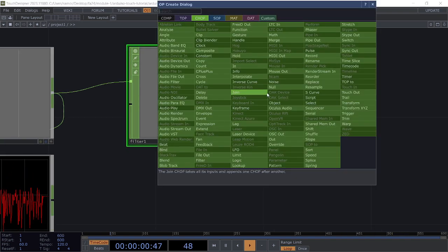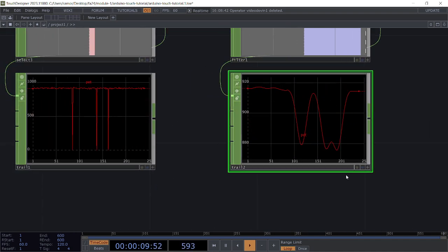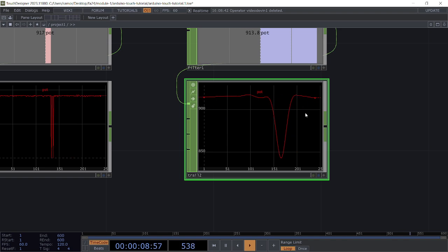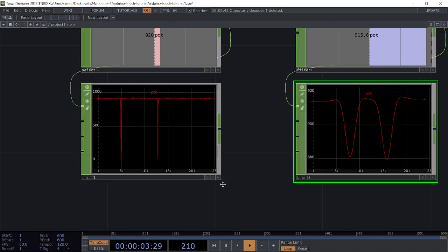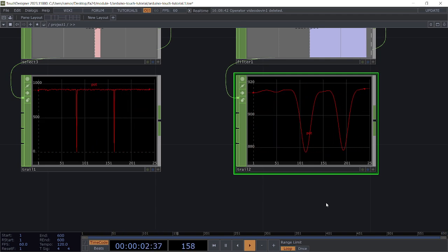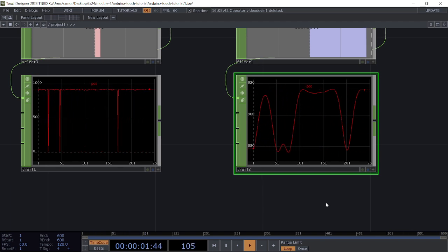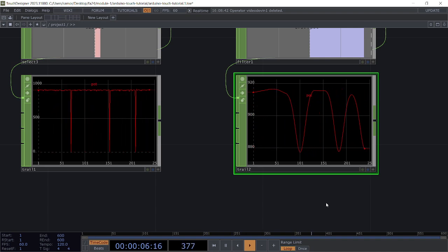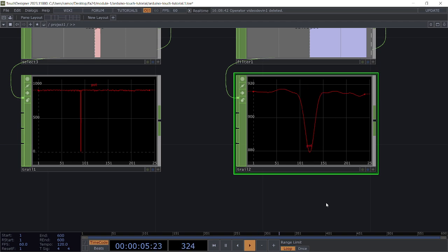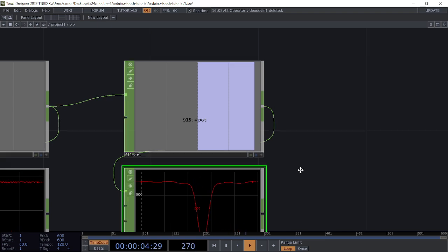So for filter, now I'm going to compare this trail to my original one, and we can see that it is a lot more consistent, right? Now it's just dipping between 880 and a little under 920, versus over here, where we can see dips all the way down to 0. There could be a few different reasons why these dips occur. One reason is there's just natural noise that happens when you're supplying current to these components. Sometimes these currents have big fluctuations, and when we're using a potentiometer on the board for other components, we may not see that or it may not be as noticeable. Here, when we're actually looking at and breaking down the values, it does become more noticeable. So a filter helps smooth that out and make it more consistent.